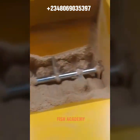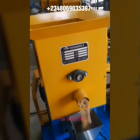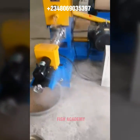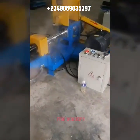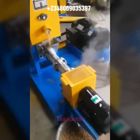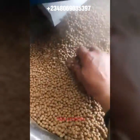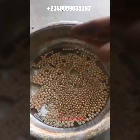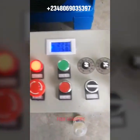This engine produces a floating fish feed and it is going to answer so many questions regarding fish feed production on your farm. The pellet machine I've been supplying before does not produce floating feed — it only produces sinking feed, and it comes out in a longer form that you have to dry under the sun before it breaks. But this particular engine dries the feed upon coming out from the machine. It comes out very dry and it cuts — you can have dies for 2mm, 4mm, different sizes. Once you place the feed into water, it will float immediately.